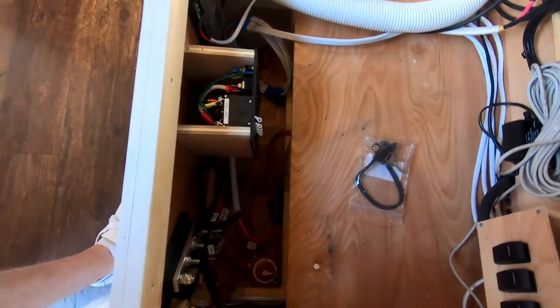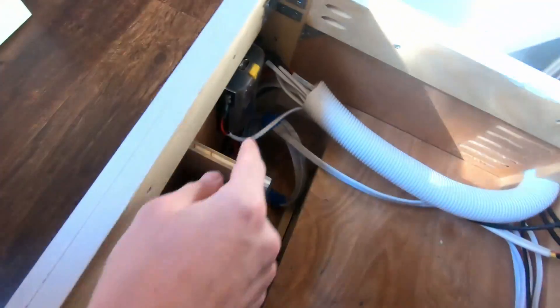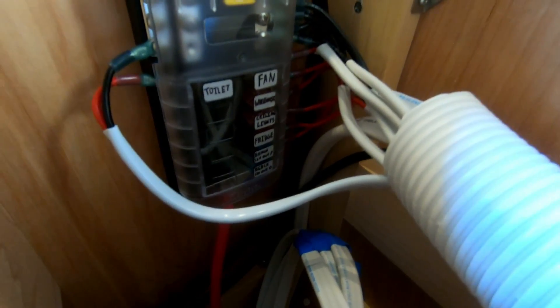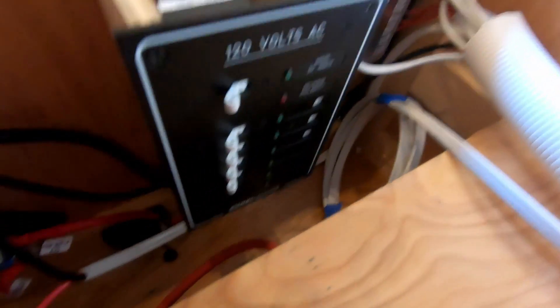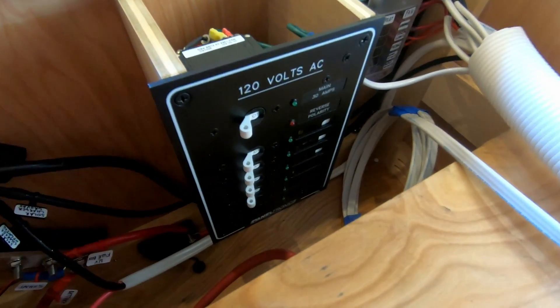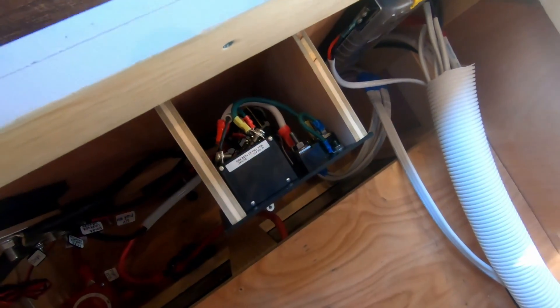As far as wiring goes, AC is actually pretty similar to DC. If you look at our DC system, the fuse box connects directly to the positive and negative bus bars from the batteries, and the fuse box has all of our DC appliances — the fan, the WeBoost cell phone signal booster, the lights, the fridge — all just connected to this fuse box where you put individual fuses to protect all your DC appliances. The same thing goes for AC: everything goes directly from the output of the inverter over to this 110 volt AC fuse box, and all the wires run from there to their AC appliances.